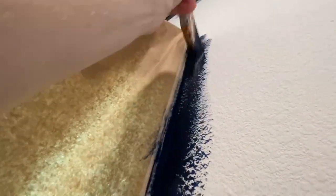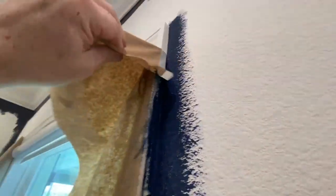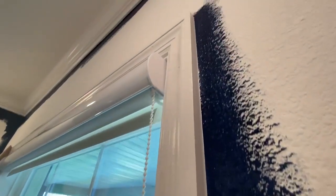You simply brush the area going up and down, what I would say aggressively. You're not pushing the bristles into that tape. You're simply going along parallel to that tape. And guess what? With minimally two coats, probably three, it'll look just as good. Check it out. When I look at that, no caulking there. But you know what? This is not my favorite technique, but I share it with you because you could do it. Let's say you were out of caulking or you ran out, you couldn't get to the store, you're working, it's 9 o'clock at night. Go for it. Just use a dry brush.